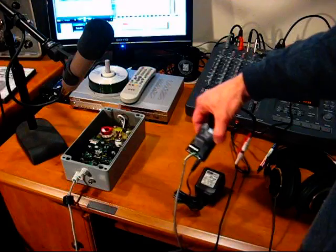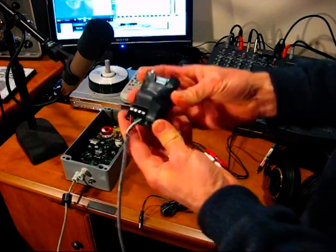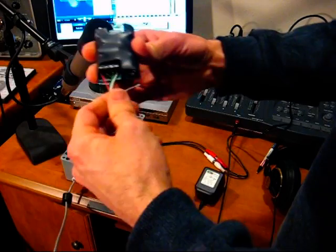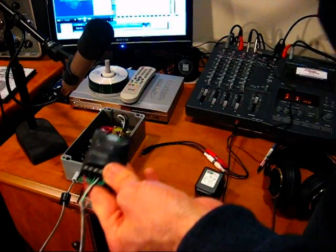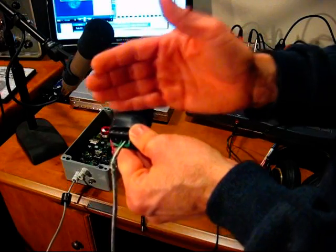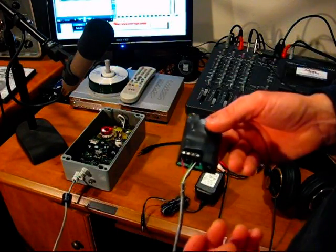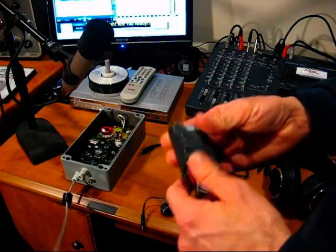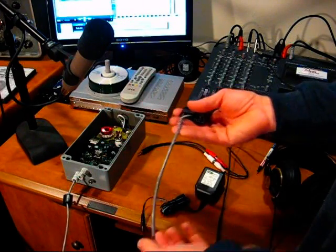And then at the bottom end, say 100 feet away, we've got our audio board that comes with the transmitter. This is an impedance matcher where your transmitter will hook up to this unit. We've got the power and the audio, and it matches all sorts of different types of inputs. You may have your computer, using different types of audio from your computer, line out or speaker out. You might be using a stereo, a shortwave radio, a satellite receiver, a mixing board, various pieces of equipment. More pro audio type equipment, you wouldn't need this. But essentially, this line will be running into your studio from up above where your transmitter is, or if the transmitter is at ground level, out in the yard.